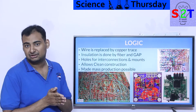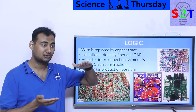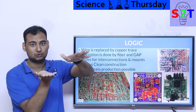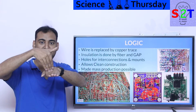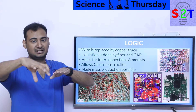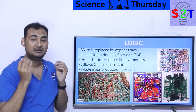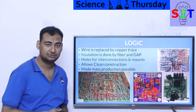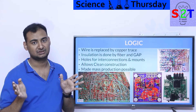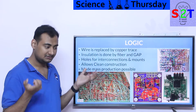How do you insulate exposed copper? The PCB lays copper flat on top of the fiberglass, so it's not flopping around. Then you mill out — basically remove — a channel around the trace, creating an insulated area, fundamentally acting like a cable. Depending on how high a voltage you're dealing with, you increase the gap and make sure nothing else can short it. That's how you achieve the electrical part, with fiberglass acting as the backbone.